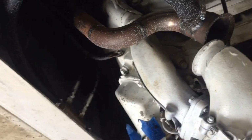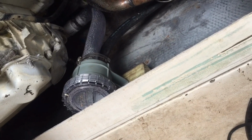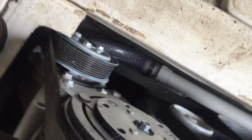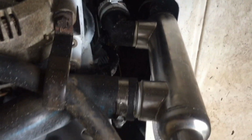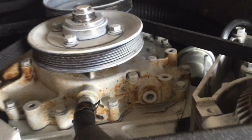There's our cooler for our transmission in there. This is our raw water filter just below the deck here. So, on all the plumbing, let me see if I can show you some of that plumbing. We brought it in, comes in down there, and we've got that little fitting there. We ended up putting a thermostat heat sensor right there so we know what the temperature of the water is. Comes around down there. Again, into our auxiliary pump and back out. And it brings raw water up into this heat exchanger. That's for the oil. And then I guess we could probably just put our other heat sensor in that thermal well right there.